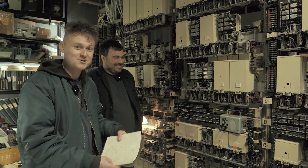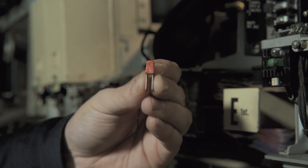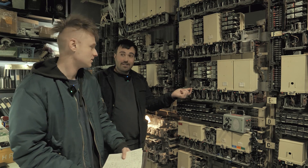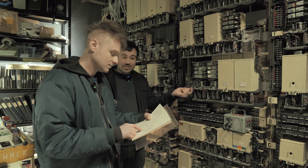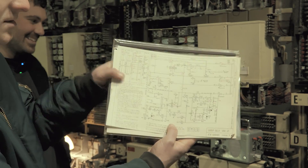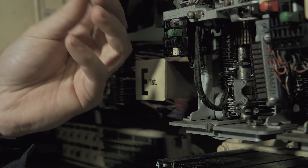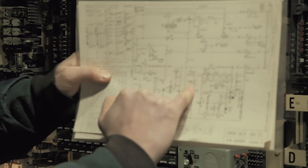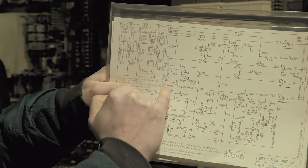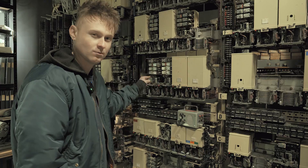We were not sure exactly where to put the U-link after it got pulled out. This U-link here, which is normally in points 13 and 14 — that's connecting the battery to the P wire. If we look at the schematic of the group selector for the UX13, this is the schematic and that's the thing right there. When you disconnect this red wire, what that does is it stops the battery being connected to the P wire, which is the wire that tells the rest of the telephone exchange that this is ready to take a phone call.